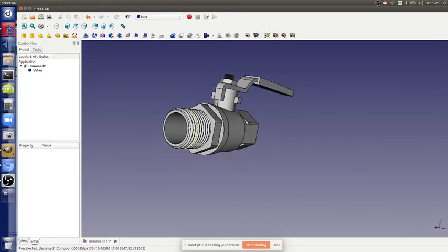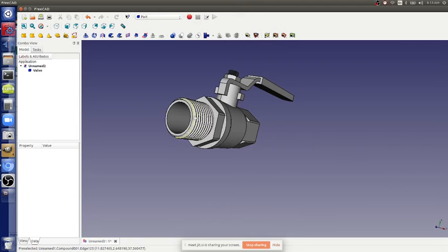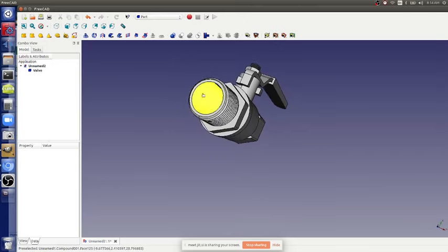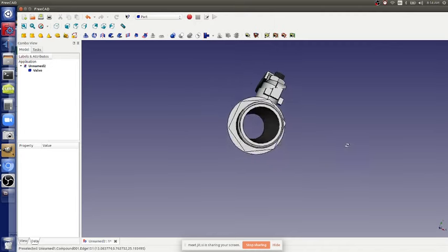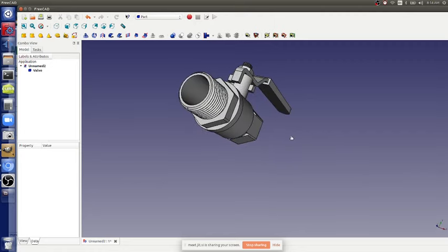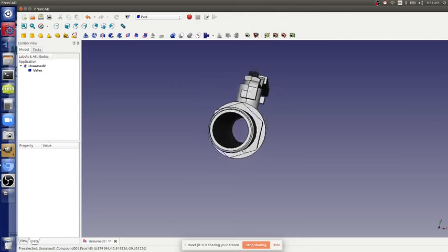In a large process, there's a part out there. If you were to search enough, you'd find a CAD part for anything. GrabCAD is another place that's got a lot of files. You're always looking for a STEP. They always have a lot of SolidWorks or whatever other formats, but those are proprietary formats. The open ones you want to look for are STEP or IGES or STLs. Those are also open formats.